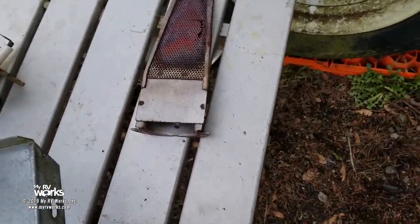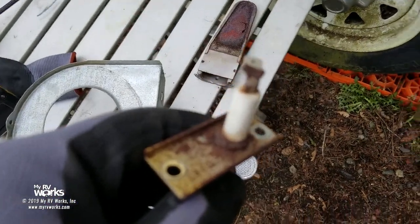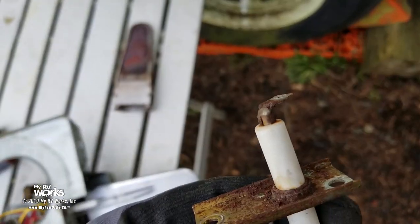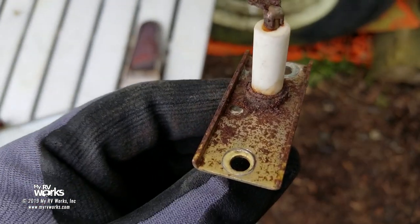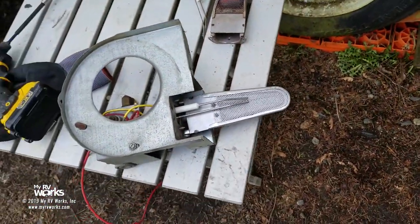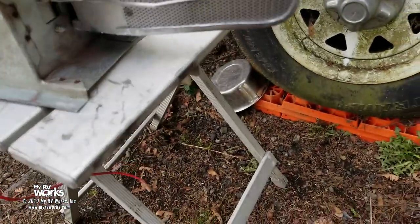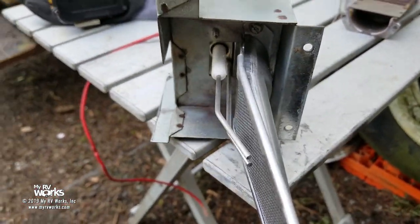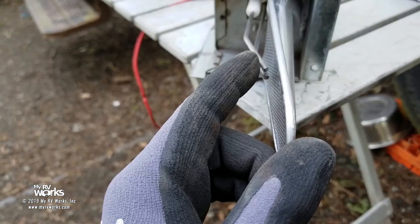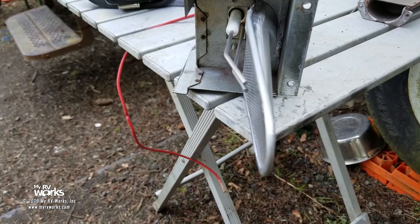The electrode — I went ahead and replaced this one as well. This one had a little bit of rust that concerned me, and there's some rust down here too. Let me explain the relationship between this electrode and the gas valve. Your burner head is in like that — we want there to be an eighth of an inch gap between the electrode and the burner head. What I do is take an eighth of an inch Allen key and slide it between those two prongs to verify I've got my eighth of an inch.